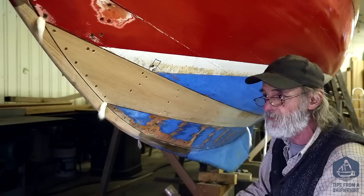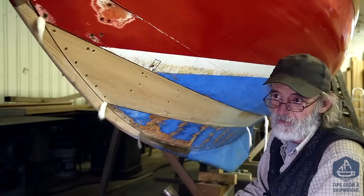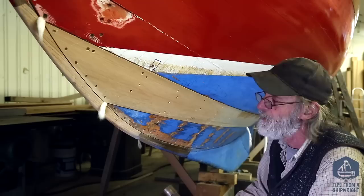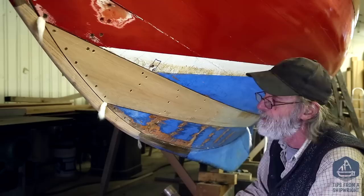The next thing is to start on the other side, which is a whole different story because I didn't put a new plank in over there. The seams are not tight on the outside or the inside, so if I tried to put pre-twisted cotton it would just fall right through. Looping it might not work either because the planking is too thin — you'd push the cotton maybe 3/16ths of an inch and it might look fine from this side, but go inside and you've pushed the cotton right through the seam. That's unacceptable. So I've got a whole different method for the other side — something I haven't really tried before, but I'm pretty confident it's going to work out really well.